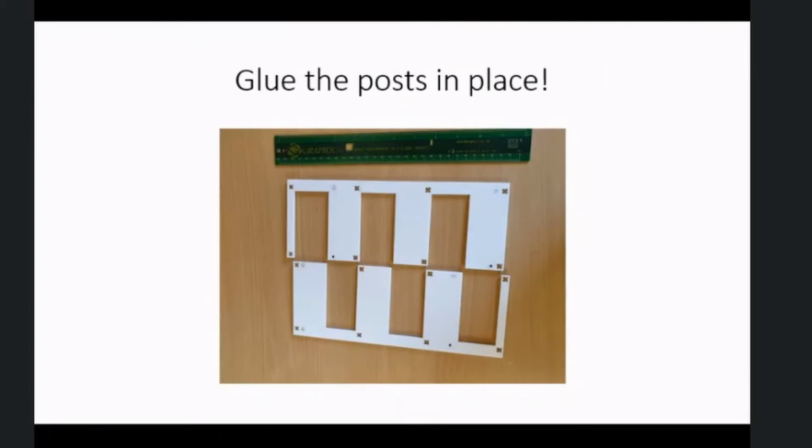So drilling holes in a baseboard accurately is difficult. But when the posts are only 3 millimeters high, there's no great advantage to being able to take them off. A bit of two-part epoxy under the post is much easier than drilling a hole and poking a post into it. So I borrowed Ken's idea of a drilling jig from a Minos quite a few years ago and made a couple of gluing jigs.